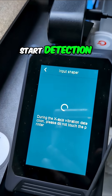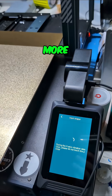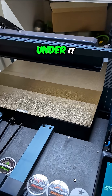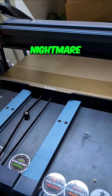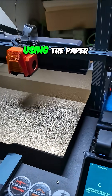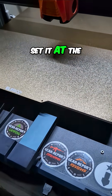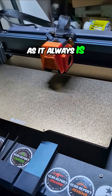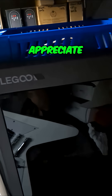This one has more manual steps to do the leveling. The leveling with the wheels and using a paper under the nozzle — that was a nightmare as usual. And then the Z height wasn't even close using the paper method to set it at the appropriate height. Super frustrating, as it always is. It took way more time than I'd like.